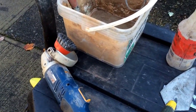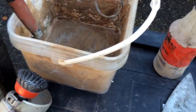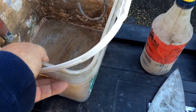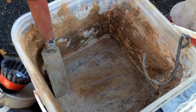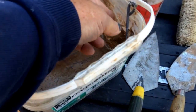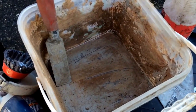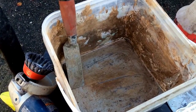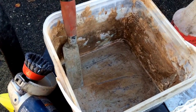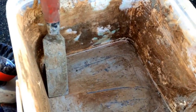It's a small amount of material, but it looks bad on the roof so I just blow it around. Here's the mortar mixing. We only need small batches of mortar, so I like to use this pail. Most of the chimneys around here are brown brick, so rather than making a pure white mortar, I'll add some brown dye to it.